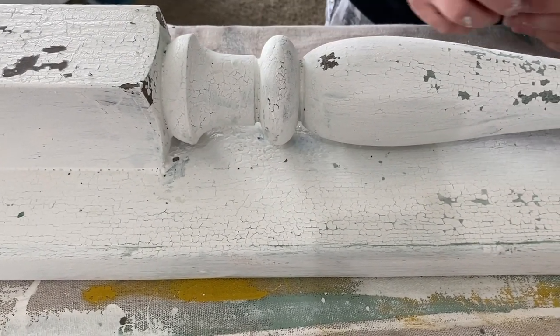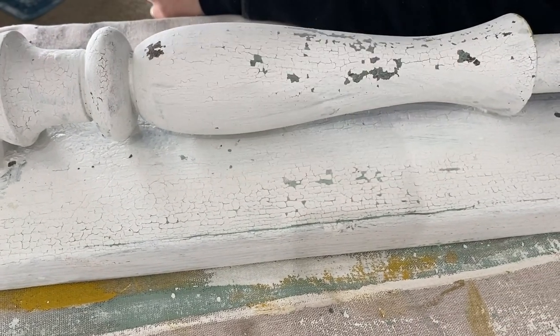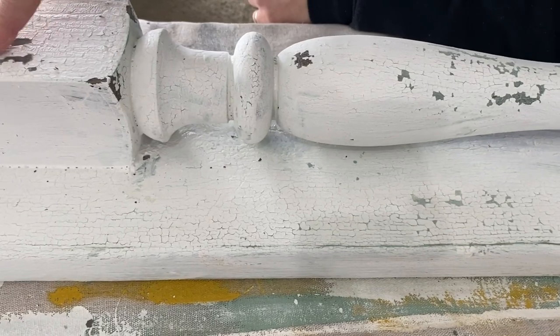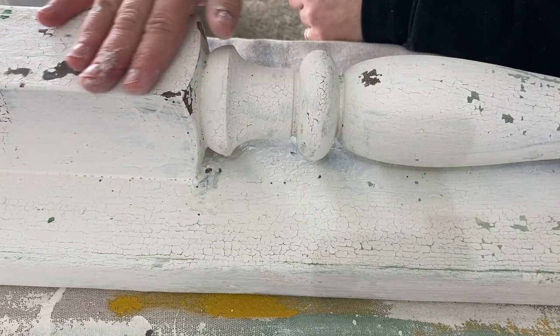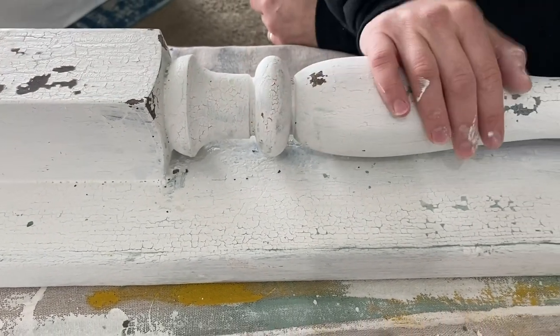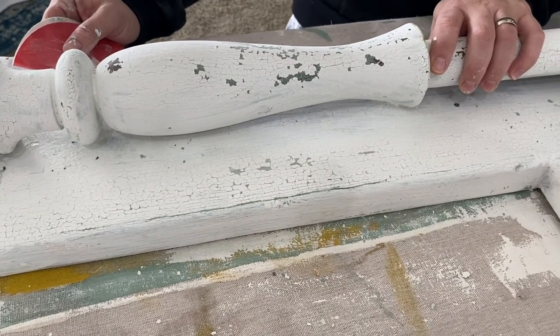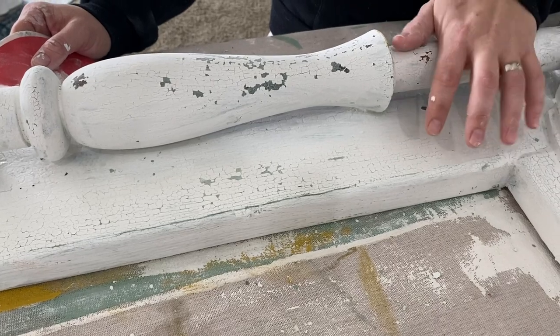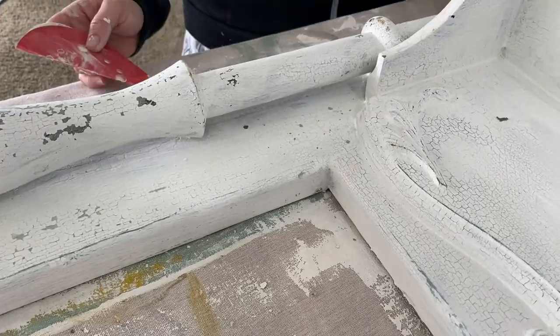Milk paint is completely unpredictable. Here it chipped down just to the base layer; over here you can see it chipped all the way down to the stained part. Some people say they don't want it to go down to this layer but they do want it to go down to that layer — when you're dealing with milk paint, it is what it is. You don't get to pick what layer it goes down to; you don't get to pick where the chip stops. So just know that ahead of time.